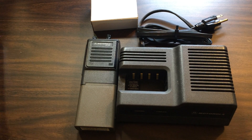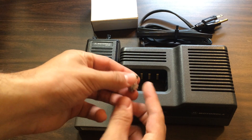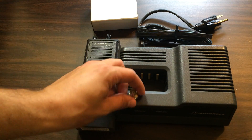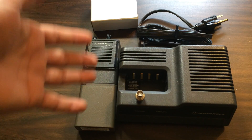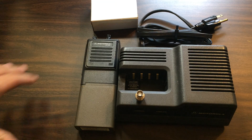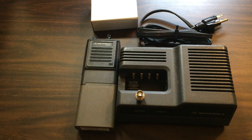So what I did was get an adapter that converts that connector to a BNC. The adapter doesn't change that there's no ground lead, so you're basically stuck to a rubber duck or a whip type antenna. There is a rubber duck antenna for this one, but it's like $20 and it's not going to work for DX at all.